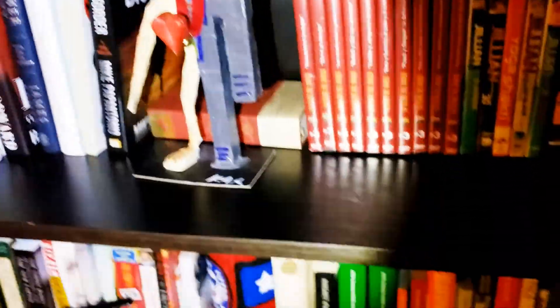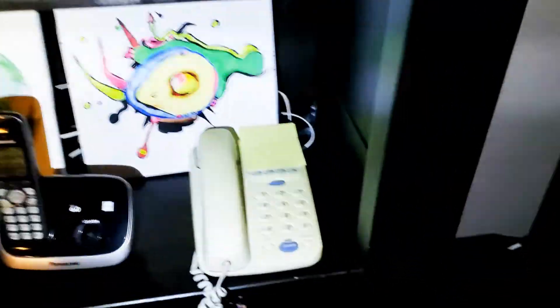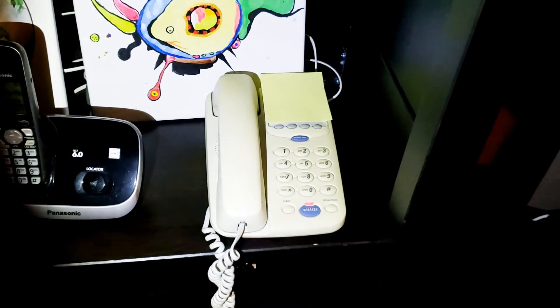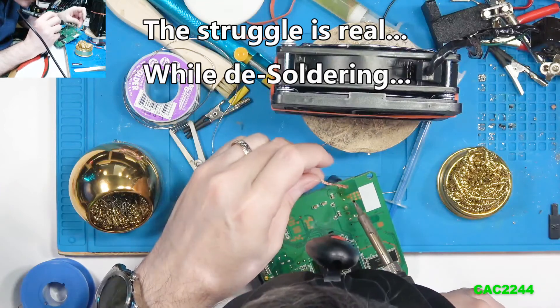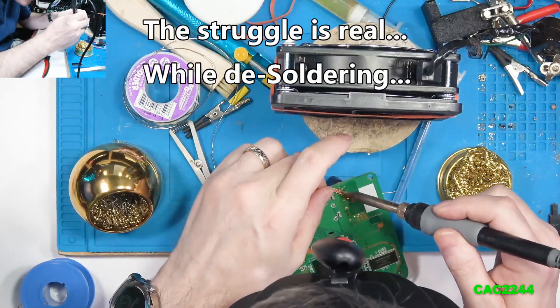The telephone LED, which hadn't lit up for maybe a year or so — we had been using the Vonage app on a cell phone for the last 12 months — but as soon as I reconnected everything and it recognized the phone, the LED went back blue. I fixed this box, and it should be good for another 8 to 10 years until the caps die again.